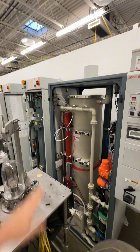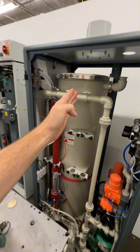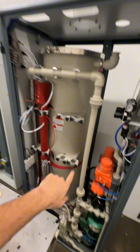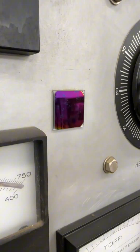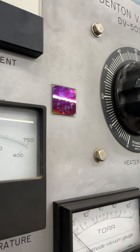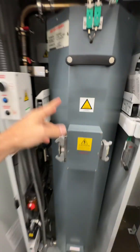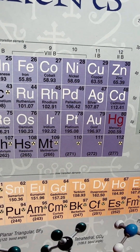Look at this frame. Correct me if I'm wrong, but the idea behind a gas reactor column is you've got something like a catalyst that you're going to put your air through after you're doing some sort of reactive ion or sputtering process to make it safe and clean. So it goes through these reactor columns — there's another one there. These cartridges might be filled with platinum group metals: platinum, rhodium, that type of stuff.